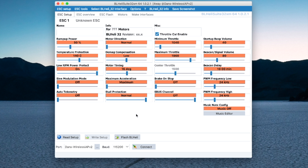At this point you're ready to connect your drone to your computer. You're going to want to connect the battery first — you can hear my ESCs beeping. Then I'm going to connect the USB port to my flight controller. The way this works is the flight controller passes the information on and connects your computer to the ESC. That's why you need it all wired up and basically working as a functional drone before you can make this update happen. Down here where it shows the port, there's a new port — on a Mac it shows as a USB modem. On Windows it'll be a different COM port. You need to make sure you select the correct one and tell it to connect.